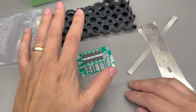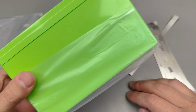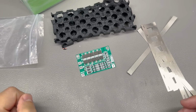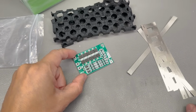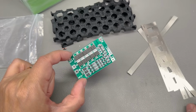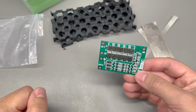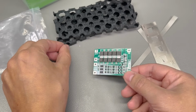And this is definitely one interesting product, because people may want to use this to replace lead acid batteries in various products like a UPS or some children's electric go-kart for various reasons, like I mentioned, increased capacity and current discharge capability. But one concern I have is with the charging of the lithium batteries, which would be handled by this tiny BMS board. It would be practically limiting the maximum charge voltage, limiting the current, and trying to balance the individual cells. But would this board be capable of charging and protecting the batteries with just a standard 12 to 14 volt lead acid charging circuitry? I don't know. It doesn't look like some high quality product.